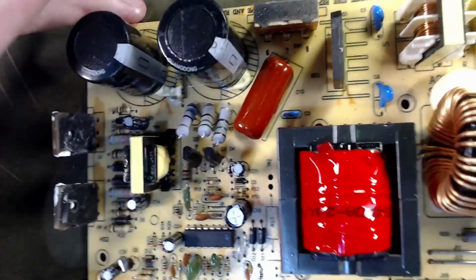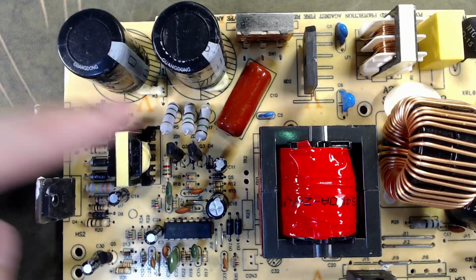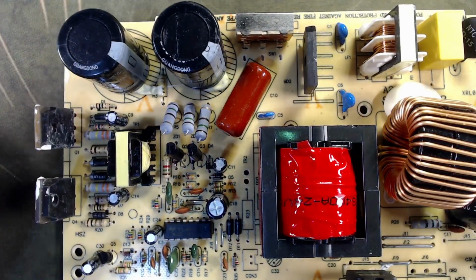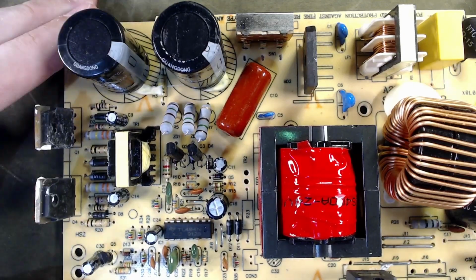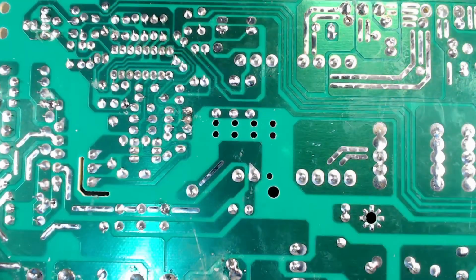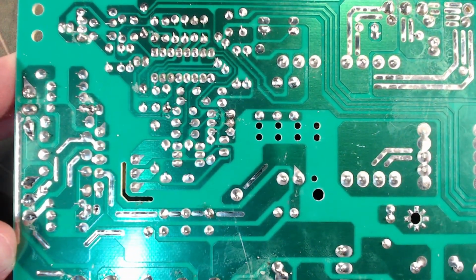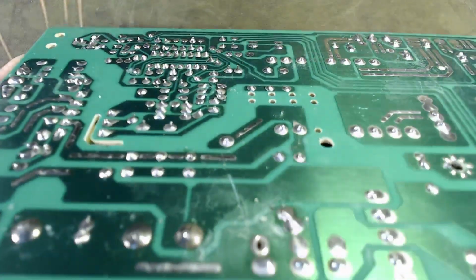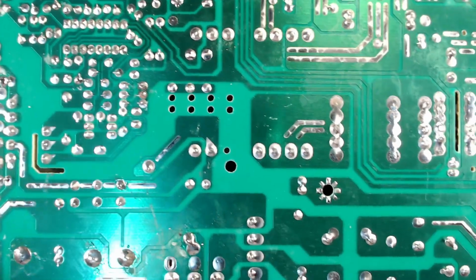So, before moving on, I will resolder some of the passive components here and these active components here, because they actually offer a risk in here. They might touch something that they shouldn't, be too close to other components, I don't know. And the underside here is not that fantastic, by the way. The pins are way too long. Don't know if you guys can see that, but they're way longer than they should be.